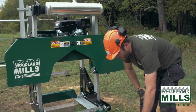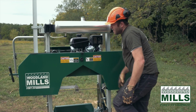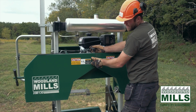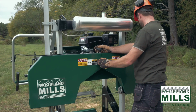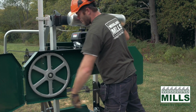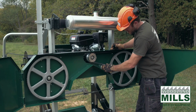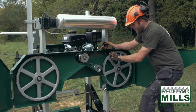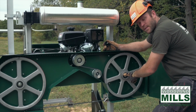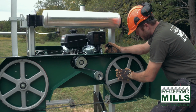But let's get the blade guards open and I'll show you the inner workings here. How we drive the band wheels. We've got 3 latches as well as a center lock. So on the drive side, we use a BX series belt. We've got 19-inch cast iron band wheels with bearings pushed from the back. So it's got a double stack of SKF bearings. They're pushed in from the rear and held in with a clip. They're the same size both sides.